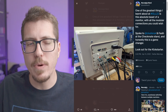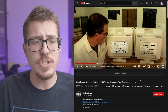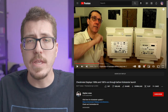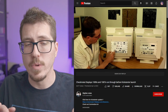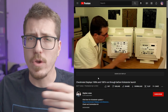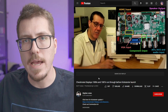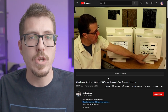If you look at this other picture, we get an interesting look at the features this monitor will have — there are about 18 inputs on the back of this thing. I found a YouTube video that Stephen Jones released a few weeks ago about these Checkmate displays. Each of the rows on the back panel is a separate module. The bottom one is the main input and driver board, and it has both analog and digital inputs — two composite inputs, a component input, VGA input, and HDMI input. What's cool about that bottom board is that there are headers so you can pass video signals from other modules internally without needing to go outside of the case.